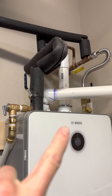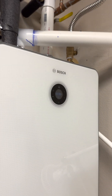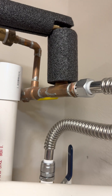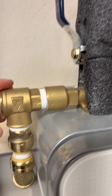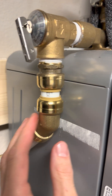For the hot water, the water connections are on top, so I didn't need the valve kit. I just added a valve on top of each line for convenience, then ran stainless steel lines to the existing copper, which was already threaded — same thing on both sides. I insulated it, and you have to have this blow-off valve on the hot water side.